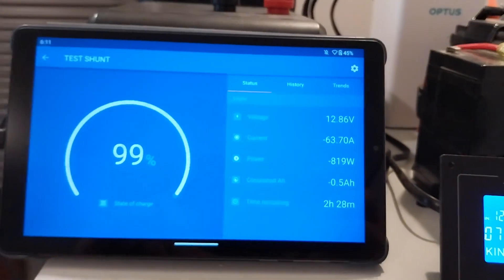Normally when you do these tests you would do the discharge at a 0.2C rate to get the most accurate capacity of the battery. But let's be honest — nearly everyone I know that lives off grid, travels, does van life or caravans doesn't run their systems and design their loads to only go to 0.2C just to get perfection out of their batteries. On this channel we do real-world testing; we don't live in a laboratory and neither do my subscribers.